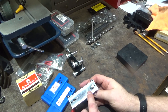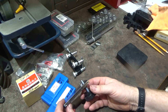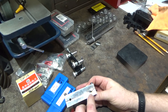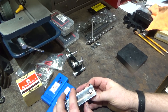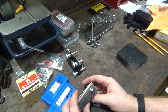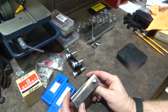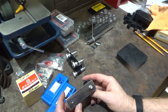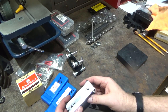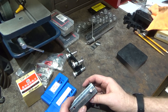A couple things to think about: this is pretty thick material I used here — a little bit thinner might have been better. Relieving this further might help. I had to pre-crimp this in the vise so the screw wasn't able to pull it tight very easily, but once I did that it's pretty darn tight. Anyways, that's it. Hope you like the idea — it's not my original, I got it from Tom Lipton, but thought I'd share it since I needed to make one. Hope you enjoyed, see you next time.